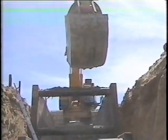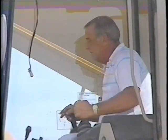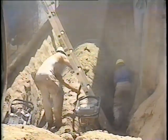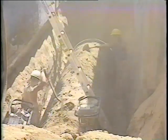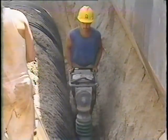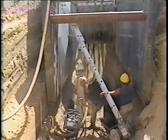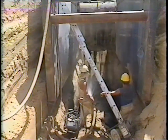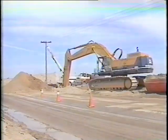After the pipe has been placed in the trench and joined, placement and compaction of the embedment begins. Bedding material is added in several compacted lifts to ensure a firm and stable envelope of soil is achieved. The first lift is dumped along the sides of the pipe and should be shoveled under the haunches to fill voids for proper support. When compacting bedding, it is important to keep the trench bottom dry — dewater if necessary. When dry sand is used, slight wetting will make compaction easier; however, if the soil gets too wet, tampers will sink and compaction will be impossible. Jetting or water flooding as a means of compacting the embedment are not permitted with flexible pipe, as erosion and loss of soil support will occur.